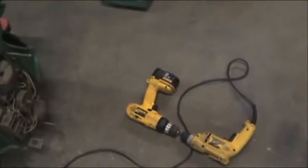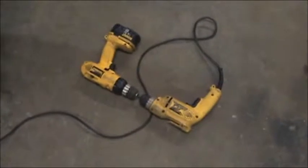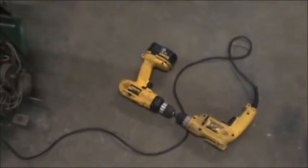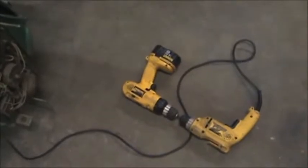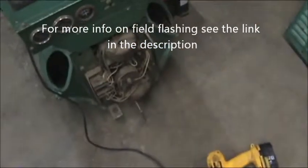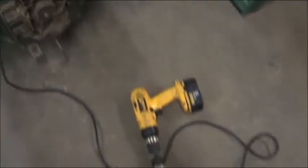I used an old trick from old electricians — some old timers will tell you, if the generator sets for too long, what you need to do is field flash it. Something about losing the magnetism, I'm not sure of the technical details, but you plug something — a drill — in.